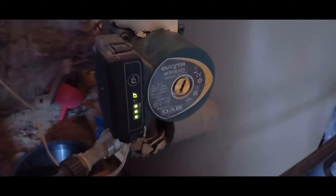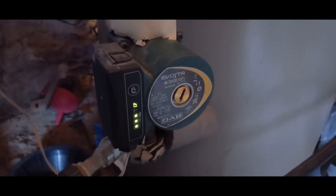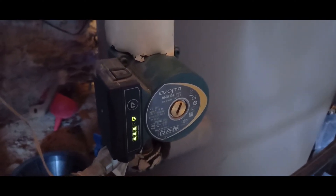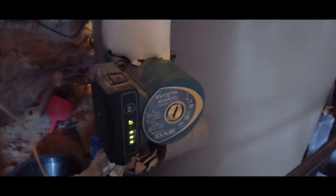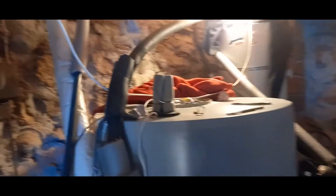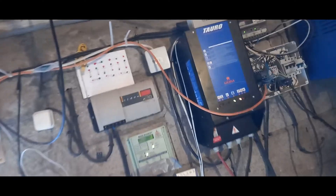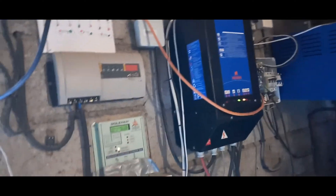Here you can see the pump light — that means the pump is on, pumping water up through the solar panels in the house above. If we could get up to 65 degrees, that would provide loads of hot water for maybe five or six people to have nice long hot showers. We're using a system which detects when we have full batteries, and then dumps electricity into the hot water.